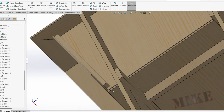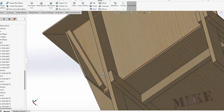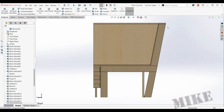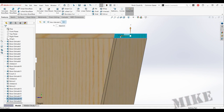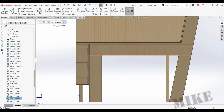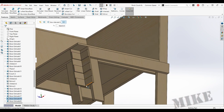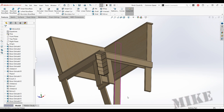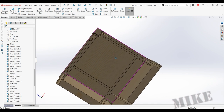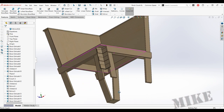This back piece here is just a rectangle — 30 inches wide, believe it or not — and this eliminates the compound miter at the corner. Then this one is just a standard miter cut, and it's supported by this one-inch wide three-quarter strip in the corner, all glued together. This is a much simpler corner joint and it's extremely strong. Those corner top caps do just have a 45-degree miter and they screw down into the four leg pieces. The top cap is half-inch plywood with a 10-degree miter on the front. This frame is really rather simple — it just kind of looks complicated. And this is of course in the cut list at the end.